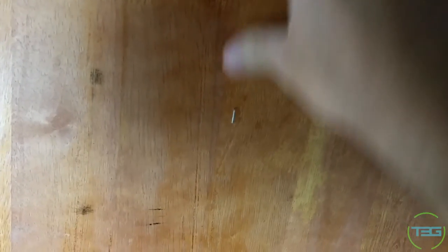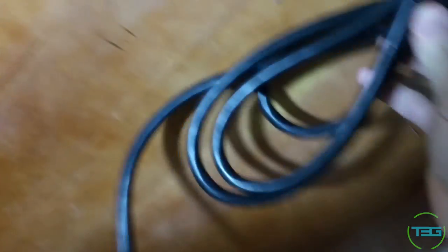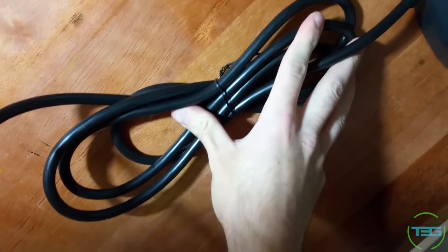Another thing that you can do on the cheap, if you don't care for the underside of your table, which I don't know why you should, it's the underside, nobody's going to see it, and as long as it's hard underneath here, some tabletops have a very soft bottom and this won't work, but as long as it's real wood or plywood that has a tough underneath, you can use staples to make these hooks and then use a zip tie to attach the cable to that, so it'll be flush against the table. As you can see, I used quite a bit of them here on this table previously. So once again, if you have any doubt in your mind the double-sided sticky tape will not hold it up, I was literally pulling myself up with one hand and that wasn't letting go. I do have to pry it off, which I'm going to do right now.